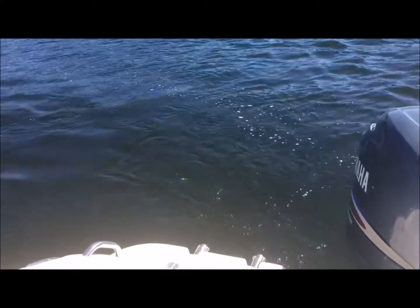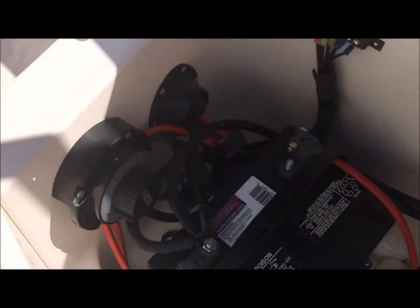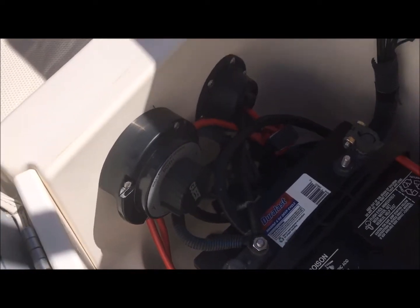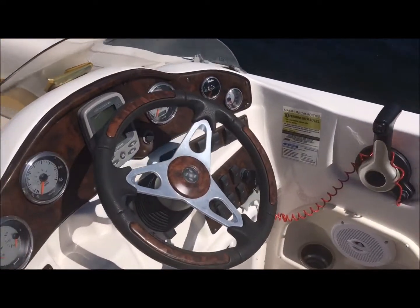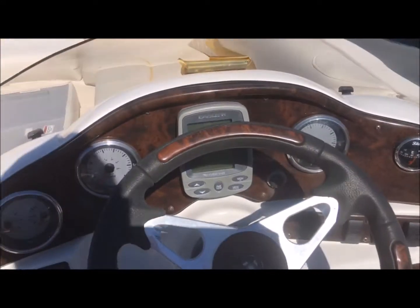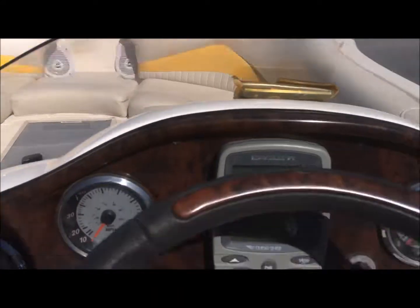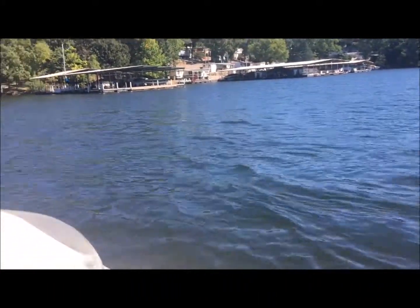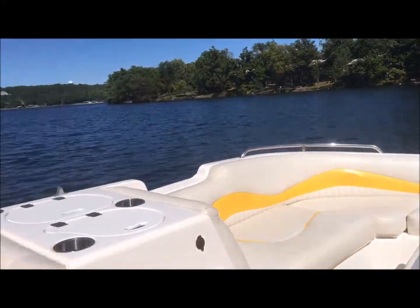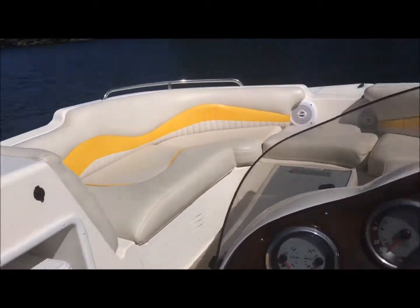Okay, so now let's go have some fun. We're out here on your boat. Second thing we do when we get inside is we turn our battery switch on right here. Switch that to one, two, or both. The stator from the outboard is going to charge whatever battery we've selected while we're running. So normally you just put it on both. The stator charges both. And if we're going to be at the dock listening to the radio, we can switch it to one or two — that way if we go to start it, we've got one fully charged battery, and a boat only needs one battery to start.